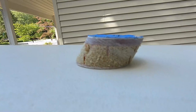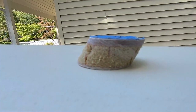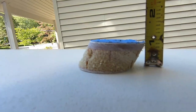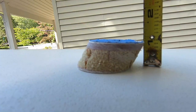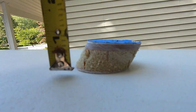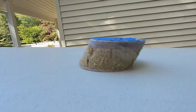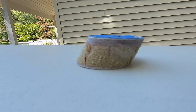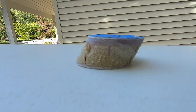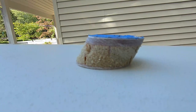Okay, now here's what we took out of the cap. This is the thickness of the cap where we mounted the rod holders, and it's almost an inch thick. It's pretty strong — really strong. There are numerous layers of fiberglass on the top, and probably only about two or maybe three layers underneath, which is actually fine. Then you have the foam core, and that's why through-bolting is so important — because screws aren't going to hold into that foam core. When you have a bolt with a backing plate, it's going to be much stronger.